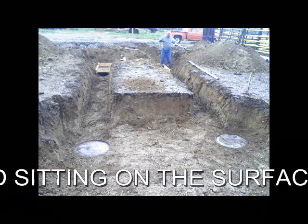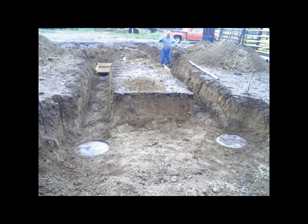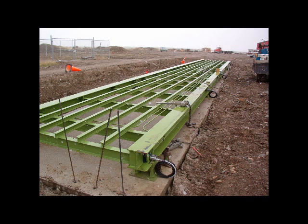In this picture, you can see trenches dug between the piling sections. Simply place rebar in these trenches and use the dirt walls as your forms. This ties the sections together and keeps them from shifting over time. In some states, a solid pad is required under the entire scale. In that case, trenches are not required as the pad will hold everything together.